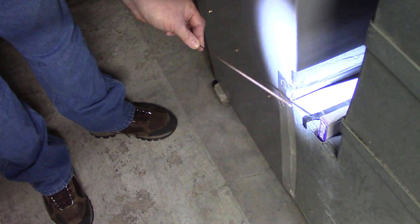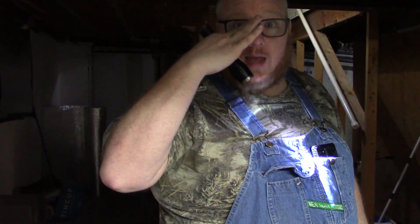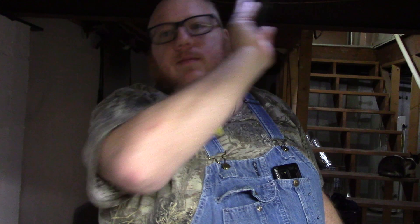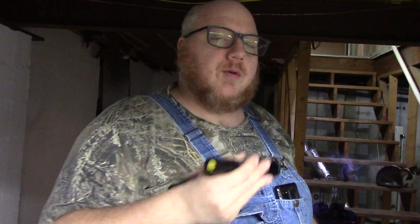The purpose of your air filter is protection for the equipment — it just happens to benefit you by cleaning the air. If you've got air bypassing this filter, you're not sucking air from the upstairs in the conditioned area that you want to condition, because remember you're paying money to heat and cool that air.